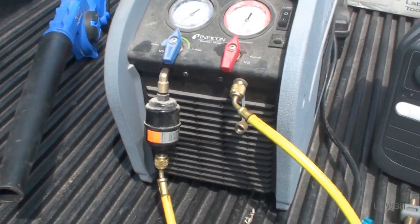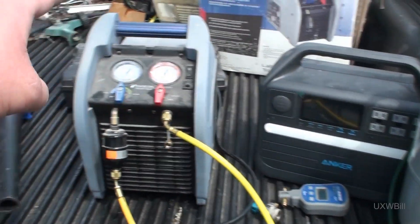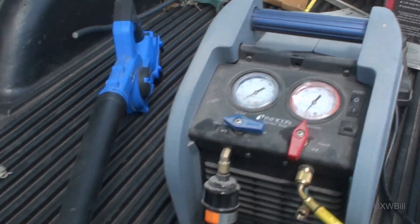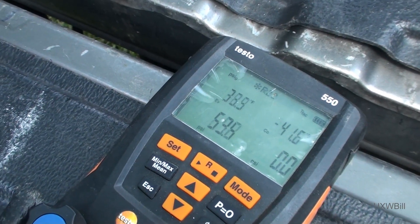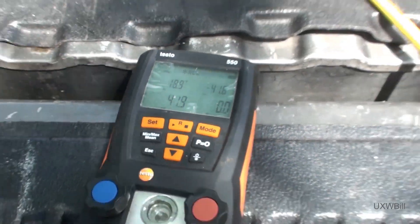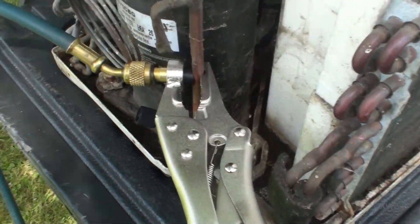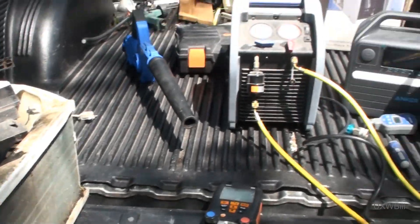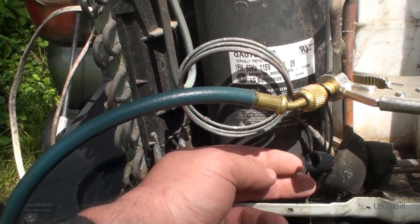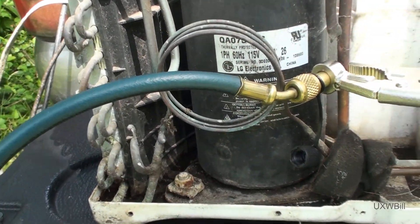All right — now I know our lines are truly bled. So we'll turn this on. I meant to mention it: the inverter in that thing would not start this machine, so I'm glad I didn't discover that while I was trying to do this. This will probably take a couple of minutes. We might even see some frost start to build on the bottom of the compressor here — it's certainly cooler to the touch down there. Because so much of the refrigerant is going to be trapped in the oil.